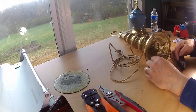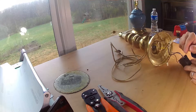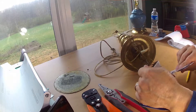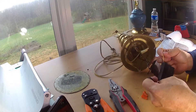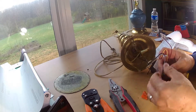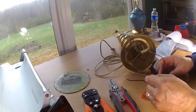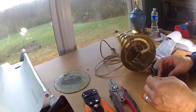So what we'll do is disconnect this and I'll show you how it's connected — how it connects up when we put the new one on. We'll go ahead and open it up and make sure the wires all match up. We've got the yellow — that's going to be your ground. The brown is going to be the power going to the lamp side. The black is the power going to the main power side. And the gray is your neutral — you'll connect both the cord side and the lamp side together. So it looks like it matches up, so it should be a pretty easy swap.